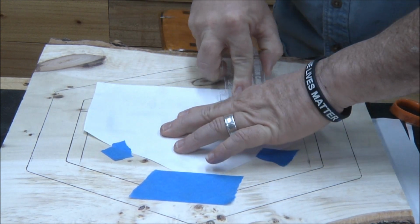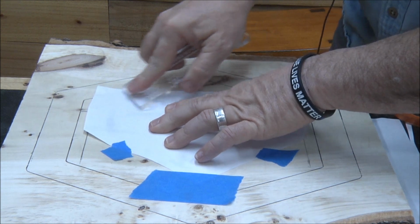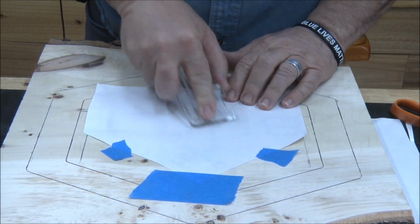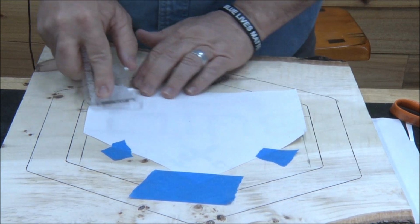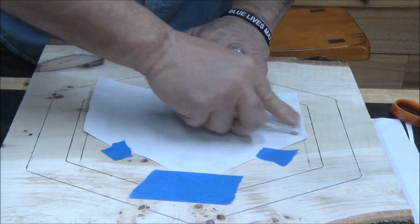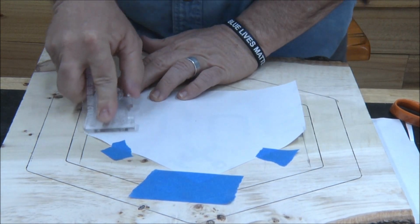You can use a laser jet printer and some kind of a process like a lacquer thinner. I've used lacquer thinner, acetone. This is still my favorite. And I know a lot of people would rather use carbon paper. I've used that. I've carved through paper. The reason I don't necessarily prefer those: number one, the carbon paper, it's really easy to get off line with carbon paper when you're trying to do that tracing, besides the fact that it's super time consuming.